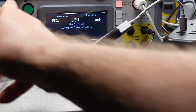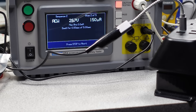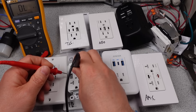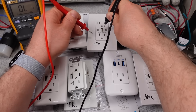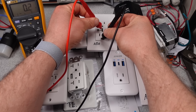They both did stay on, but one is going to last a lot longer. In terms of isolation — which separates the dangerous mains side from you on the low-voltage side — these adapters were quite all over the place. The plug-in one was not bad but interesting, the larger name brand devices tested worse here. But in general, these all should not cause the tingling feeling you sometimes get from a laptop or phone screen, because they will be fixed to the 120-volt circuit and were all at acceptable levels. Some of the cheap ones actually did much better here. When looking at the ground connection to the USB ports, one of these devices — the Abotech — has a diode in that path, so in one direction there's a direct connection to earth. This is different from all the other devices, which had the same isolation to earth as all the other AC pins — meaning they were not connected at all. A soldering iron is an example where earthing makes sense, but this device doesn't have the power for that anyway, so I'm not sure why they went in this direction.